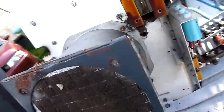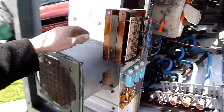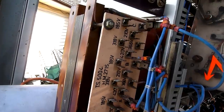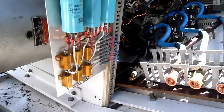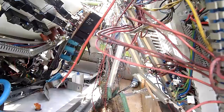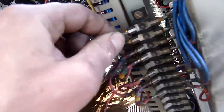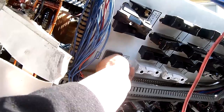Big step-down transformer, cooling fan - it's three phase but I've got a VFD that'll run that. It's a little axial three-quarter horse cooling fan, two pole. There's a multi-tap transformer, some caps - this is all fairly new RS Components stuff. This drive would have been manufactured in the 1970s. SCRs for days - two, four, six, eight - there's about 24 of them in there. Not a bad little score. You can see how old it is: it uses little spade terminal strips, and there's a bit of modernization like some of this stuff, but even that's an old Telemecanique switch.